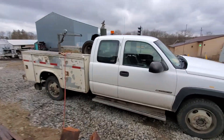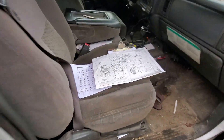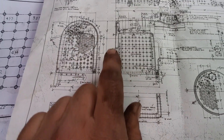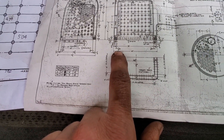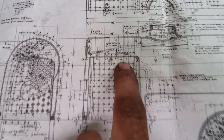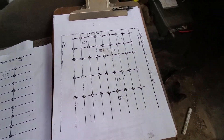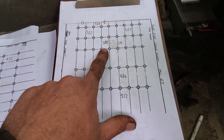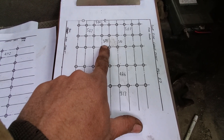So I'll show you here on the boiler drawing. The boiler drawing says that the plate thickness should be three-eighths of an inch — three-eighths there, should be three-eighths there. Well, he went in, took some ultrasounds and look what we found: five-oh-seven, five-oh-nine, five-ten. That's not three-eighths of an inch. That's half-inch.